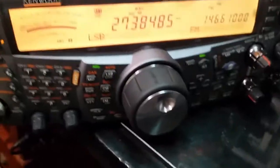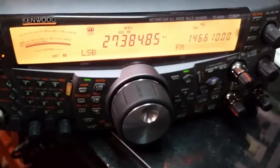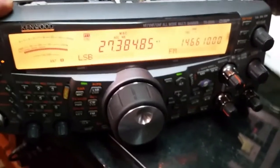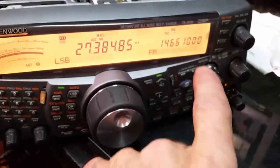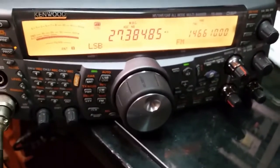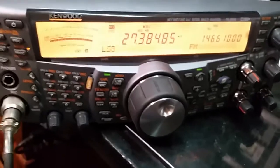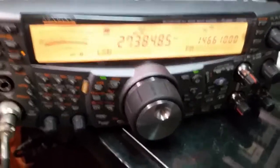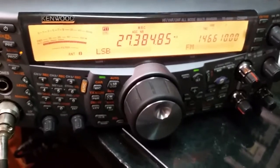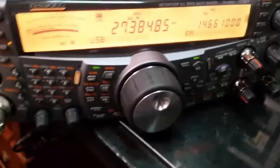For anybody that wants to do the ALC on a TS-2000 to get full power out of the radio like you're supposed to — and by the way, you can still turn the power down if you don't like that much power. I've got her maxed out because that's how you manipulate the ALC, on full maxed-out, balls-to-the-wall power. Once you get it set, then you drop your power levels to safer zones.